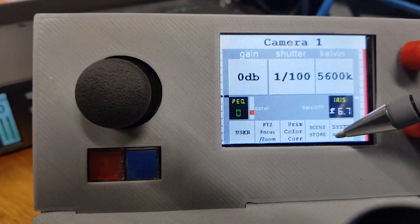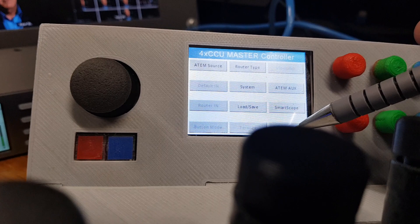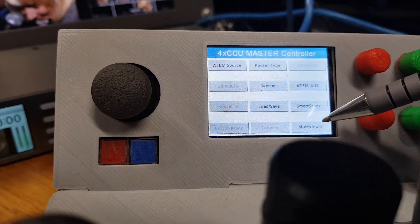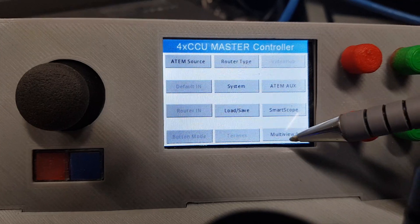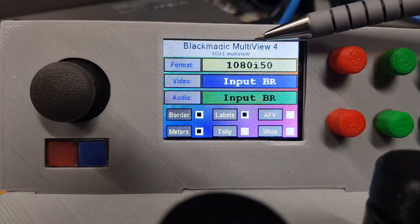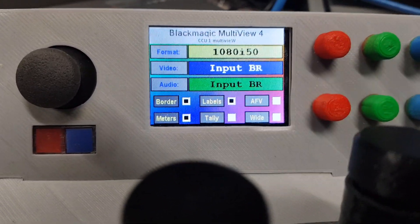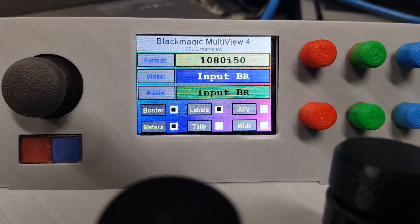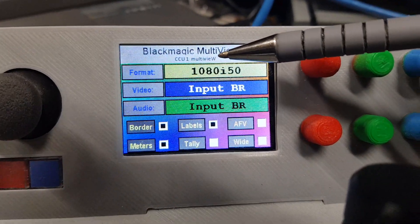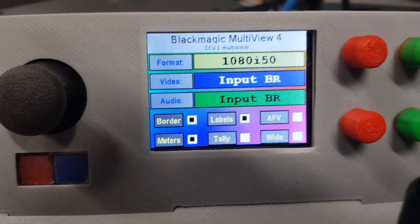If we go into System Setup we can see down the bottom here we have Multiview 4. These other units are grayed out at the moment because I don't have an allocated video hub. But we do have an allocated Multiview 4, so that's why it's not grayed out. I can select that and we come up with a menu screen. At the top of the screen it tells you the name of the device — this actually comes from the Multiview 4 when we connect to it. All this information is supplied as part of its data. There's also a sub name here which you can set both on this unit and on the control panel that ATEM provides for the Multiview 4. You can set a device name, so if you had multiple Multiview 4s you can give them their own unique names.